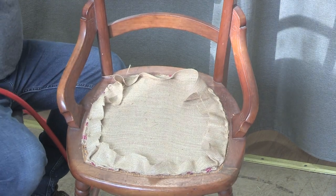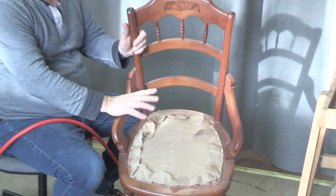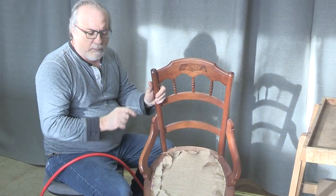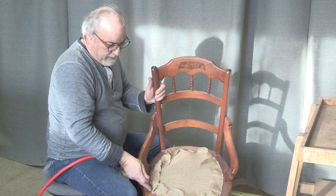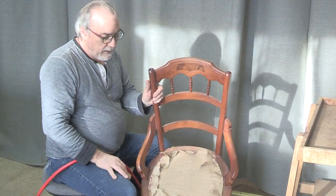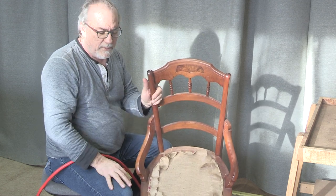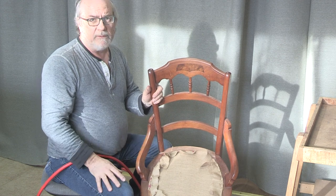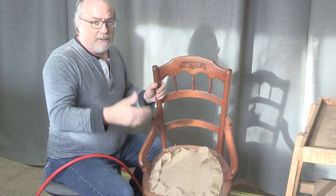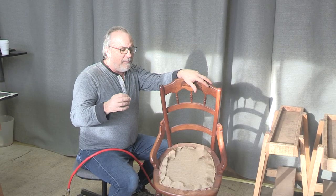You're upholstery ready. I'm probably only going to put, believe it or not, a layer of cotton over this and the fabric. I'm going to pin-tack my fabric on around, a little bit over the edge here, and then put French nails in it. It's important not to stuff this out too much. Everybody wants you to overstuff things, but you don't want to overstuff this. Keep to the profile. That's it — we'll see you next time. Please subscribe.